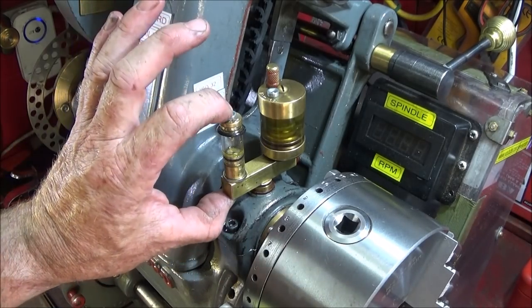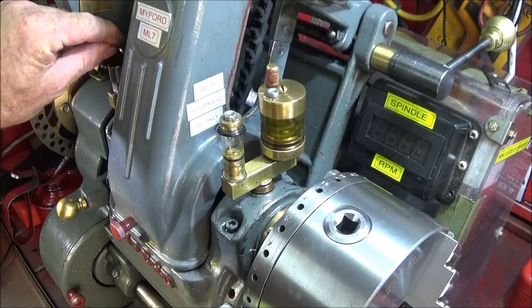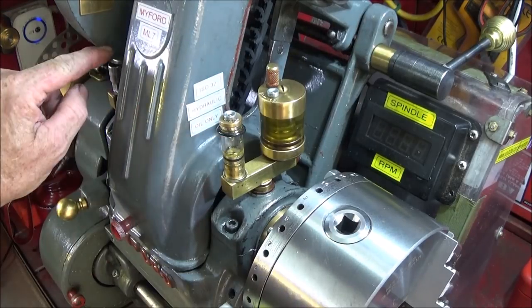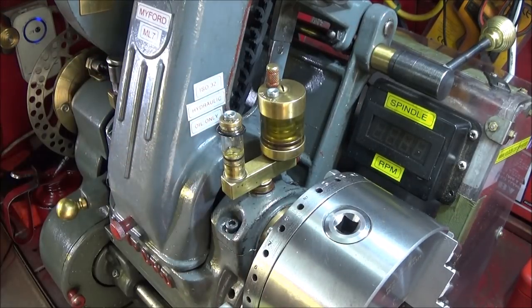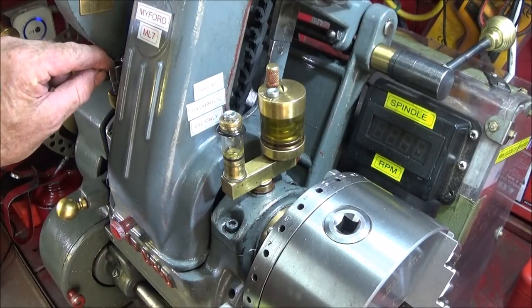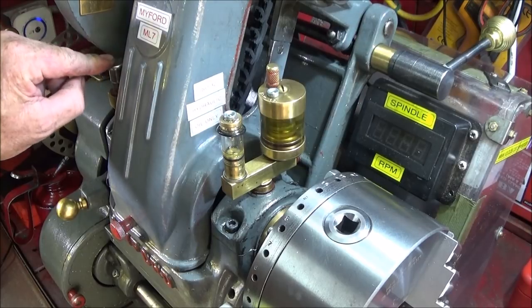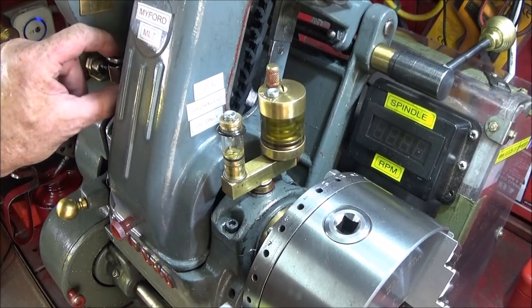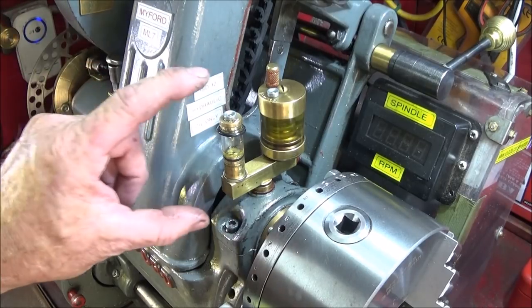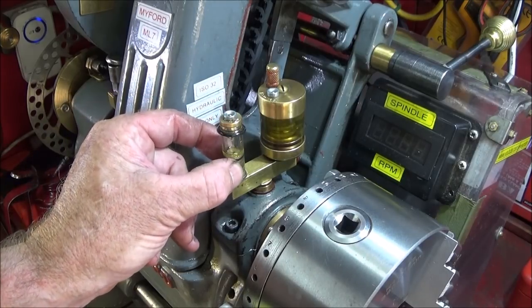Now on the front here I had the cap or cup oilers, like this one here with the little hinge door, and I had that for some time, but I do actually machine a lot of brass, and I find that you can still get actual brass chips in the oiler cup, particularly like this one here. It's come off from the pin at the back, and so it's not closing properly. So I've made up a new system here on the front using a piece of polycarbonate tubing.